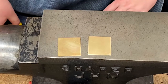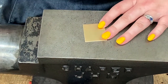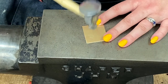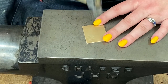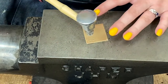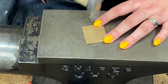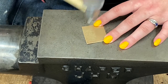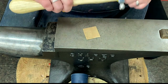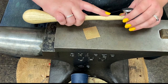Let's go in with our ball peen. The biggest trick here is to not hit your fingers, so I'm just going to start hammering. I'm going to overlap the strokes so that it doesn't look like polka dots and instead looks more like a cobblestone pattern. If I were to use the flatter side it would be more of a planished look — just kind of gently hammered. Now, I am not choking up on it and I'm not putting this finger down. If you do that, your finger joint bears the brunt of the force of the hammer popping back up and it'll actually hurt you, and you have to do more work.